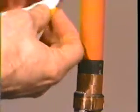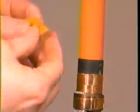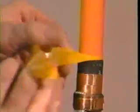Remove the backing from the short angle cut piece of the SRM. Place the tip of the SRM at the semicon cutback and stretch it to approximately 1/2 of its original width. Tightly wrap 3 to 4 layers so that the semicon step is filled.